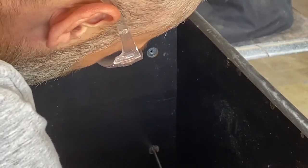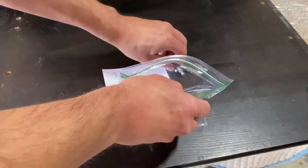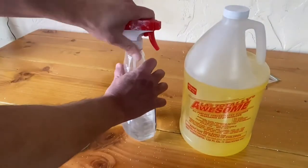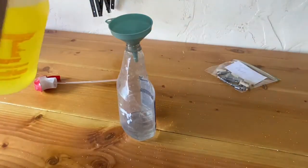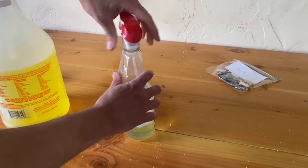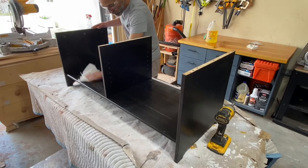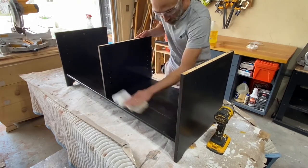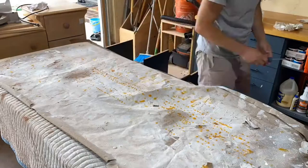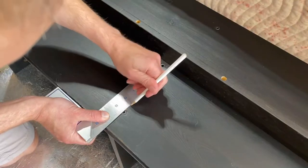The first thing I needed to do was to start disassembling this piece. The top could come off, so that's what I did as a first step. Put everything away in a ziploc bag. I have a video about the importance of ziploc bags in the shop. As with any piece of furniture that needs to be refurbished, the first and most important thing to do is to clean it well, because you don't want to sand the dirt into the piece. You can use a light detergent, TSP, or even dish soap. Just make sure that you clean the whole piece very well — even the bottom, everywhere you're sanding should be cleaned thoroughly. The top was in really bad shape, so I made sure to clean it as well as I could.